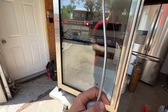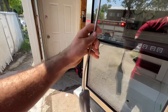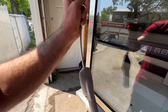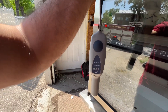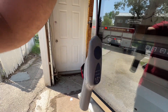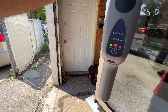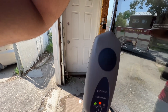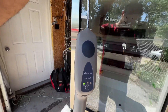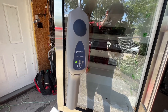Here I'll also show you another example of how the detector works. If I blow into this little small hole, you will see the beeping noise gets faster and louder. I keep blowing on it and you can see the beeps increase — that's how it responds to refrigerant.